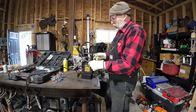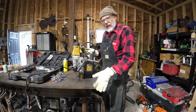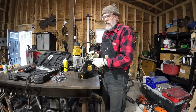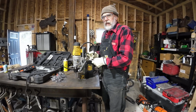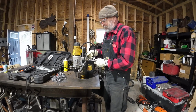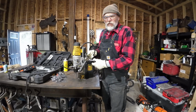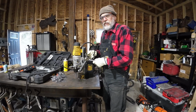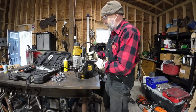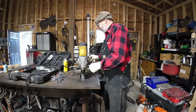And really the only other thing you do at that point is you put a chain on this and you chain it to something higher up, just in case the magnet does let go or someone kicks your cord down below. If an electrician's walking around and happens to kick a cord, like they don't care. Poor millwright's stuck up there working hard and the electrician's walking around not doing anything. Anyway, you don't want that coming down when it's on. You just can't be ready for it. You'd usually be working off a scissor lift or something like that. So you chain it up there so if it happens to come off, it doesn't fall down and nobody gets hurt. Of course, the electrician's feelings are probably hurt, but who cares?